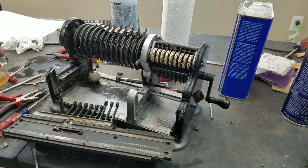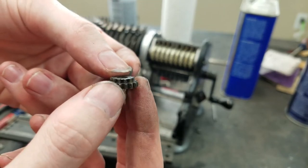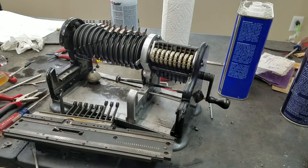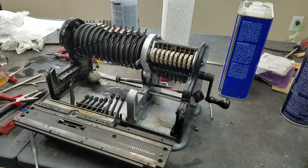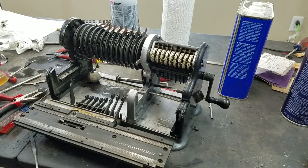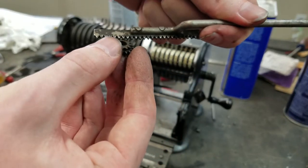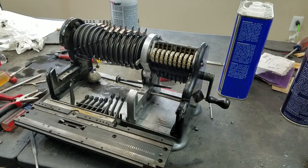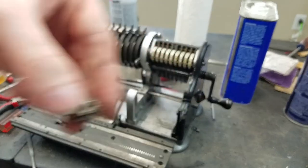Clean up the gear itself — this is a two-level gear. One of them is driven and it engages with the rail gear on the back of the carriage. The other one engages with the piece that moves the counter slider. It's right behind the back here. The front side would be the carriage and the back side would be this one — the top one. Clean this up too. Should be a brass gear, it looks like. Looks like it is.